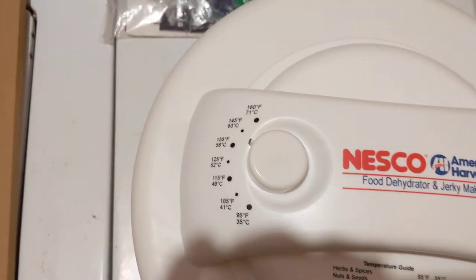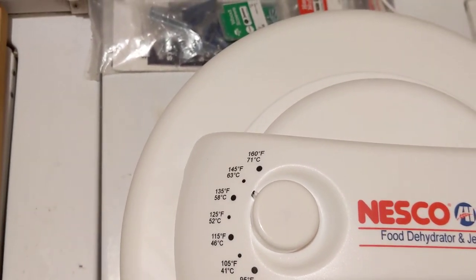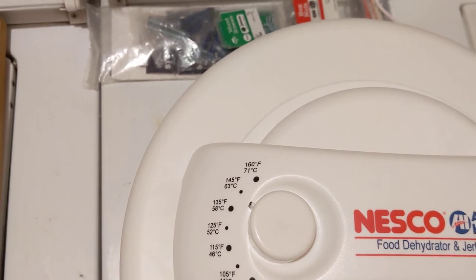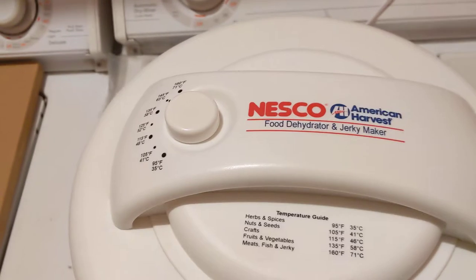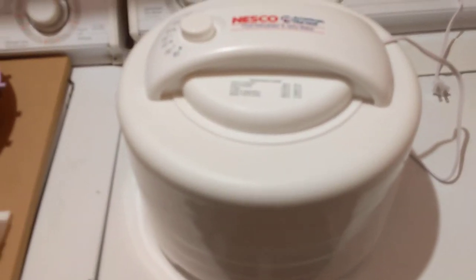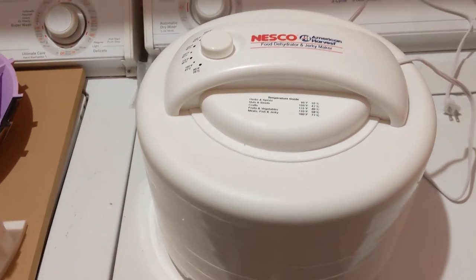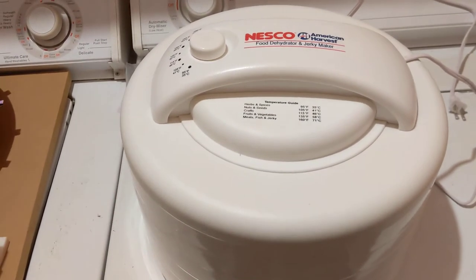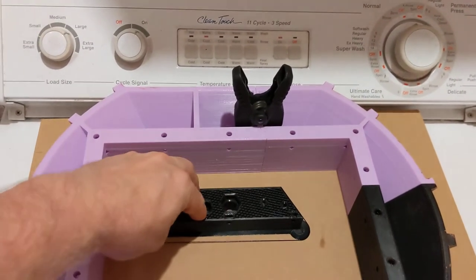And I dried the filament there. I have the dial between 58 and 63 Celsius, and I had filament in there. The one spool I put for about 13 hours. And when I first started printing, this was the first thing I printed in the white filament,